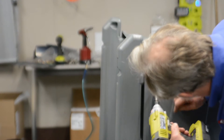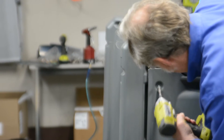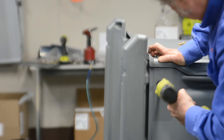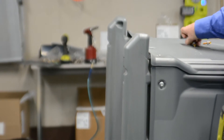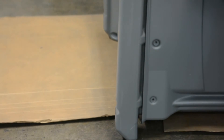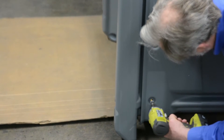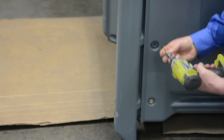Repeat on this side. Line up the insert. The dimples on the floor on this side should be lined up with it in position. Just put in the lag screws.